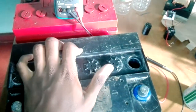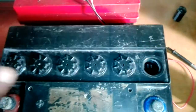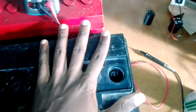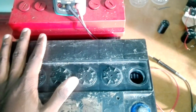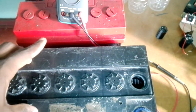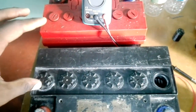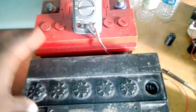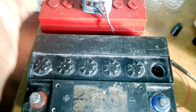When you start charging the battery from around 3 volts, the 23 volts from the charger will drop down to about 18 volts and continue dropping as charging progresses. The voltage will continue to drop until it reaches a stable value, indicating the battery is fully charged. In my case it stabilizes at 14 volts with the batteries fully charged at 13 volts — generally these batteries reach maximum at about 13.6 volts.